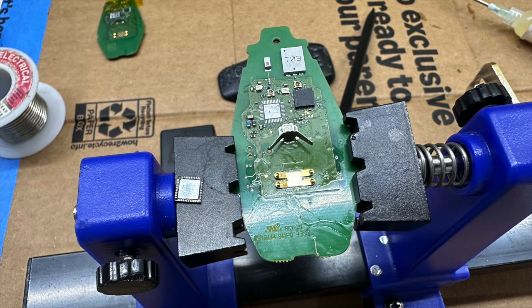Two of those are the two black squares on one side of the key fob and the NFC is the small one on the bottom of the other side of the key fob's PCB. Once that's done, we're going to use a machine that will wash the new key fob, remove all of the flux that we used, and it will be ready to go back into its housing — slap a battery in there and everything will work. The key is mailed USPS Priority back to the customer and out of the box, we're rescued. The car still had 60% state of charge in the high voltage battery and we're cruising around the parking lot just making sure all is well. We'll follow up again later — thank you for watching.